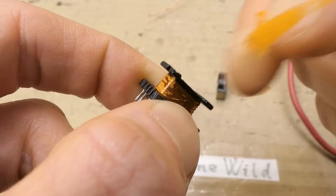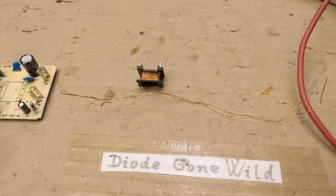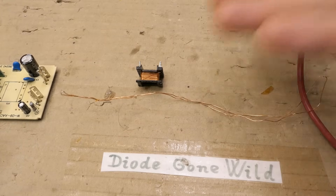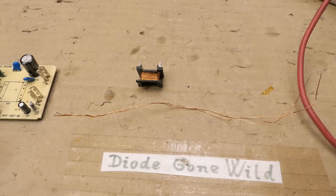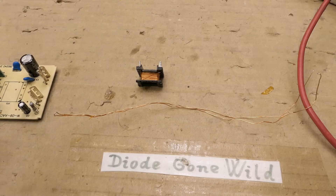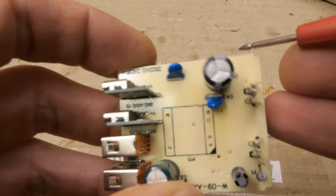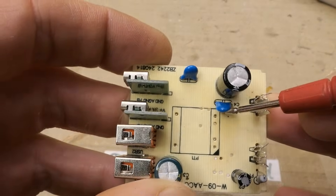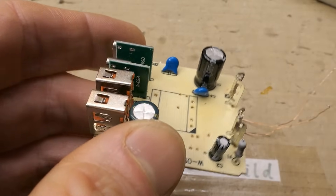There was nothing to keep the secondary from the ends of the primary - they're completely exposed. Two layers of insulation and then the primary. It's all regular transformer wire with no safety triple insulation or thick insulation - just the super thin lacquer, 0.00-something millimeter thick. This wire is not rated for applications where its failure causes electric shock. There was insulation tape between the windings, but still a couple of spots where isolation relied only on the lacquer. And they're apparently using the same type of capacitor for the snubber network and for the primary-to-secondary capacitor, just to save money.